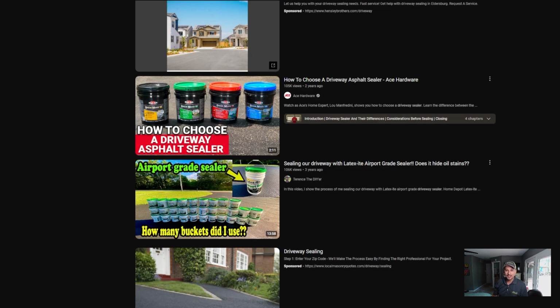This prompted when I realized one of our customers was having an issue with their driveway. Some past seal coating they did themselves was starting to crack and flake really bad. It's an ongoing trend whenever you purchase big box driveway sealers. They're just really not as good as they say they are. The buckets, usually they'll say like airport seal coating or something crazy like that. 5-year warranty. Don't buy it. It's been sitting on the shelf for who knows how long, unagitated. Most homeowners are not going to stir that material correctly.